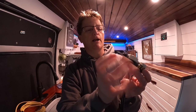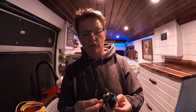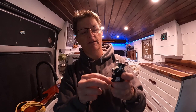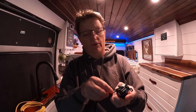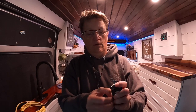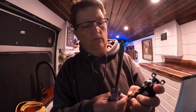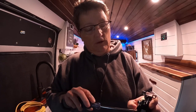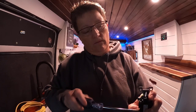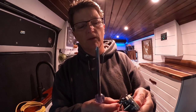Now I'm going to show you exactly how I've got this done. I've got that box dangling. I'm gonna put this on there, and then I'm gonna show you exactly how I did that, okay? All right, I've got that wrapped around there. Now you tighten that screw up. You tighten that real tight and secure that wire. That's gonna be nice. Those stranded wires, they really smash down as opposed to the solid copper.